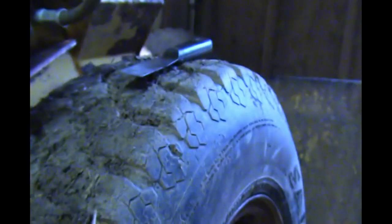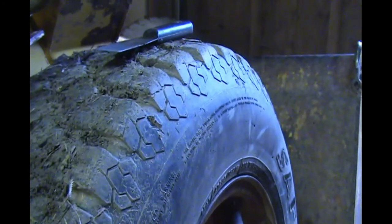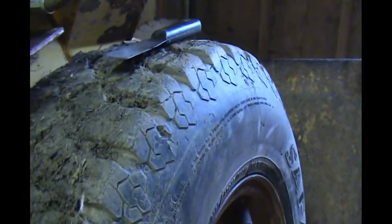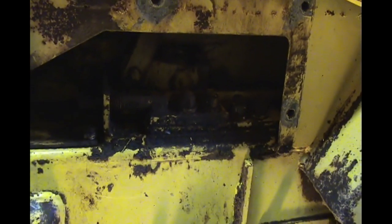And so the book says to have half to quarter inch play in your wheel. Now it's completely loose, so there's like 4 inches of play or 6 inches of play. So we're gonna do that next. We'll get that chain tightened up.